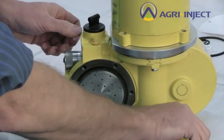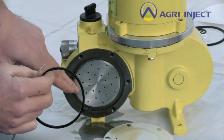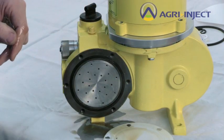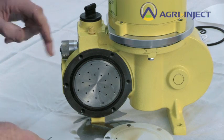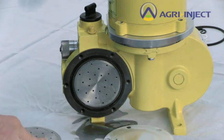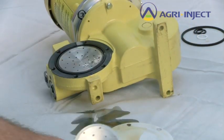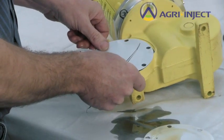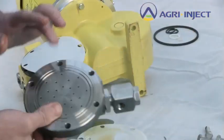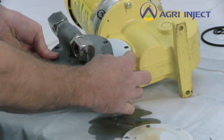There is also a square ring — just an oil seal that fits in a groove on the pump side. This is only an option on the six-bolt heads. Most pumps are going to be a six-bolt head pattern; older ones had eight bolts. As you replace your diaphragm, it is easiest to lay the pump on its side. Then you can line up your holes on the diaphragm, having them match where they should. Hold the second contour plate in the head and slide the head across the diaphragm.